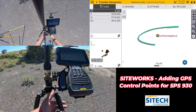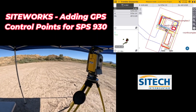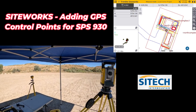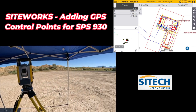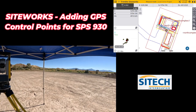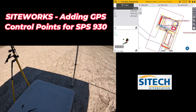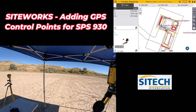We've got three control points in here now. Once you've shot all those control points in, make sure that where you're going to set the total station up, you have the ability to see at least three of them. In the upcoming videos when I actually set the total station up off of those, you'll see you can get away with two control points, but if you have three it's best to average it out. If you need to set more control around a building, it's all line of sight — set as many as you need to cover your area. Thank you for watching this video from SiteTech Intermountain on how to set up control points on your job site for a total station.